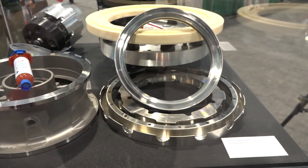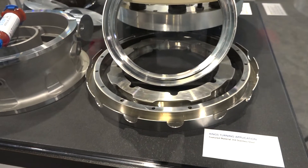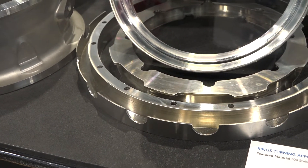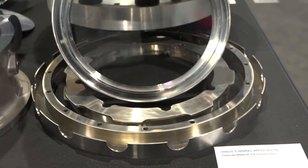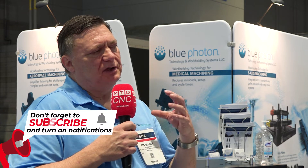Another part on show is 304 stainless steel. Why not just hold that in a clamp? Well, because we started out as a billet or a forging, and we turned it down so it's very thin and compliant. When you start removing that much material, the part gets very hard to hold on to without distorting it. With our grippers we simply hold on to the back of the part, turn the three sides — the OD, ID, and the face — and you're ready to go. Nice and simple.